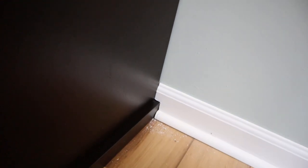Whenever I drilled the hole through the floor for the gas pipe to be run through, I happened to hit the floor joist. Odds are you're always going to have that happen. So as you can see, we have a huge hole, and that's the reason. I'm going to use some of this expanding spray foam to fill up the hole, make sure it stays nice and tight, and just kind of bury my mistake. Although I didn't do it intentionally, but yeah, it was me. Pretty skinny.